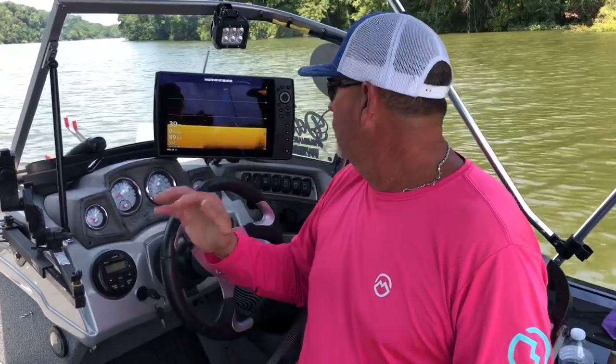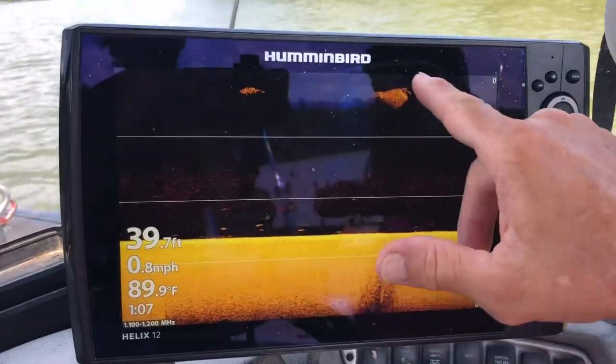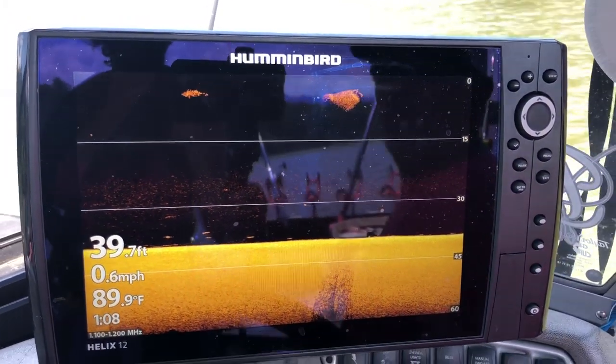If you're on side imaging and you know there are treetops or something coming up in the water, slow down when you go by them — like two to three miles an hour — and watch your side imaging. Go to your sensitivity, go to your contrast, start to play a little bit till you get them clear. Don't be afraid to hit those buttons and go one way or the other till you get the clearest possible image. You can see the shad — we just went over a school of shad; there are two different schools right below us. I tell people all the time, when we're looking for shad, they're hard to hide from me with side imaging.